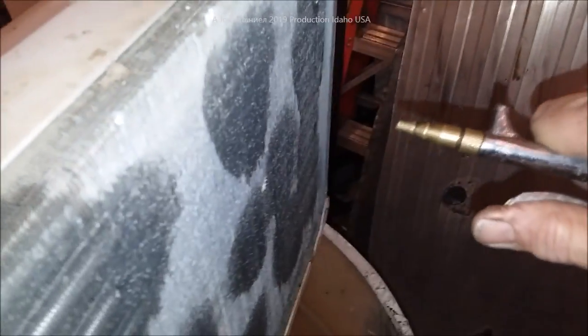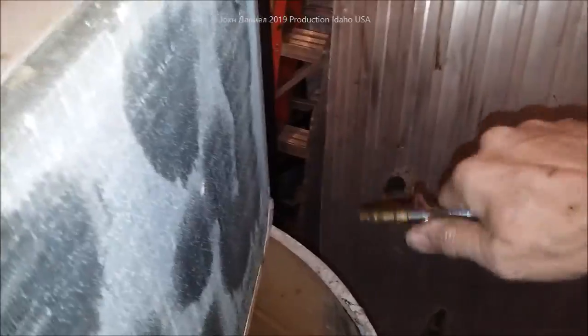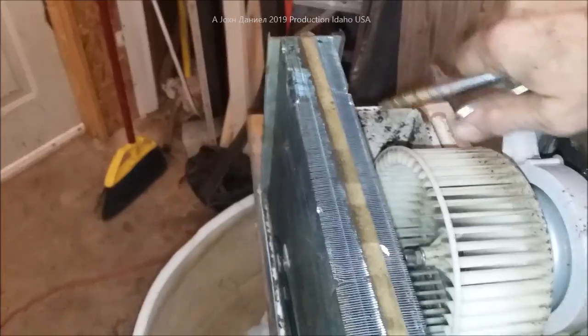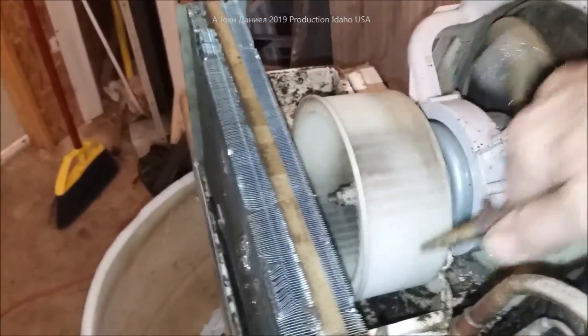I'm going to bring in some hot water. The main purpose is to spray the cleaner in there to loosen it up, then take the air pressure — stand back a little bit — and run it in there. It's going to get pretty messy. Don't get your nozzle too close; it depends on your air pressure of course, but I run about 90 PSI and hold the nozzle about four inches back. You can see it bubbling up and coming out — and now all the gunk is loose.